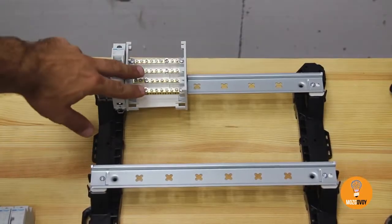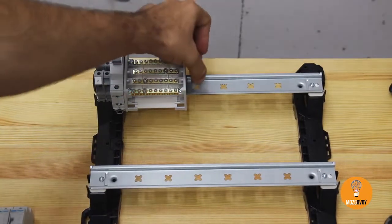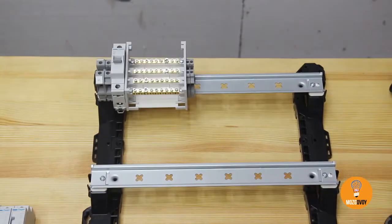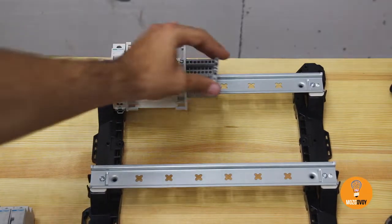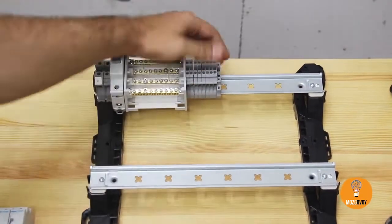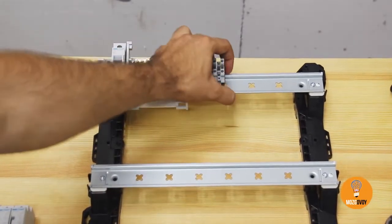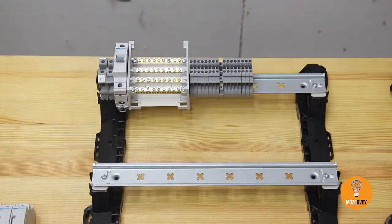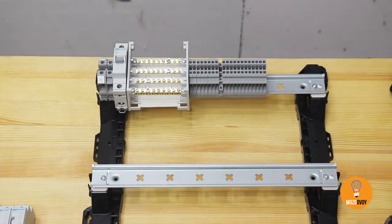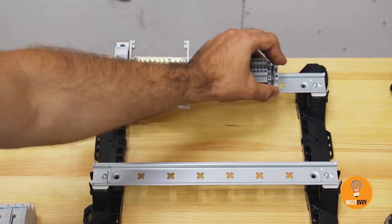In the PDB we use two bus bars for live wire and two bars for neutral wire: eight terminals for power socket units, an end cover, twelve terminals for switches, an end cover, and six terminals left for the lighting.